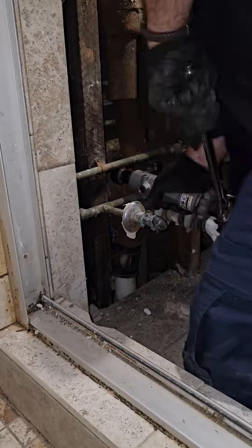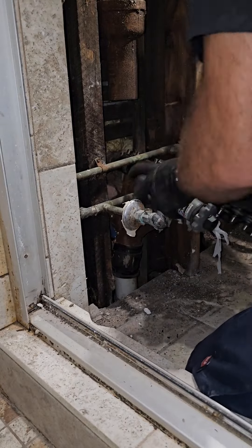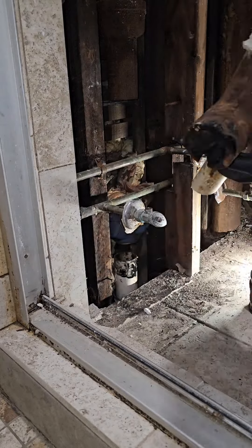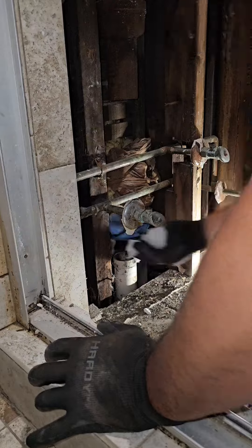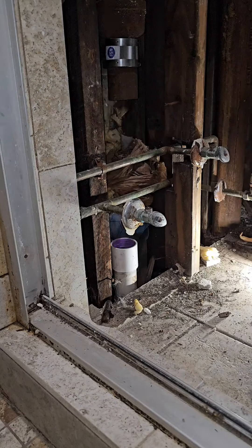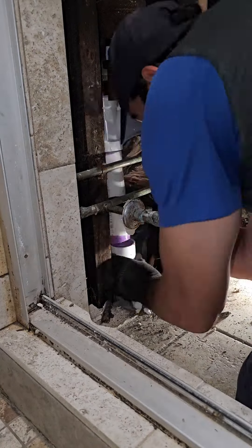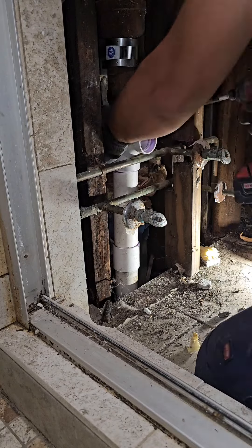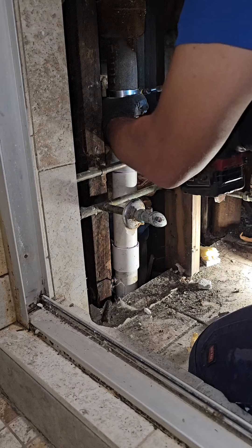I pull out the snapper, put it in there, and snap that little piece. It took me a little while to get that cross tee out because the water lines were in the way. I was lucky enough to cut that out, and I'm also lucky that I have two-inch PVC on the bottom. I glue a two-inch pressure coupling — I always use that when I can. I don't like those DWV couplings; they're too small in my opinion.